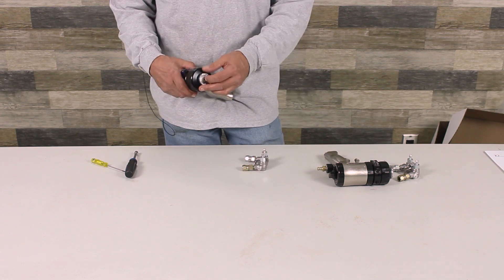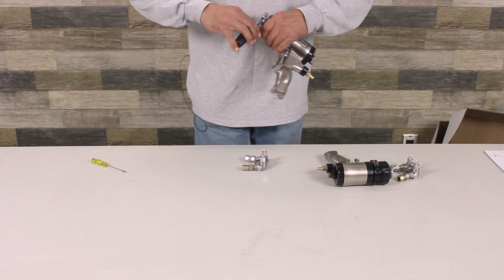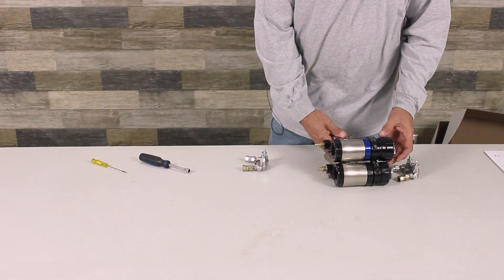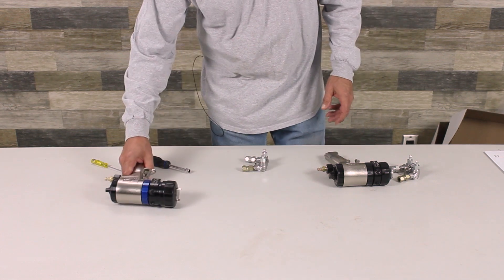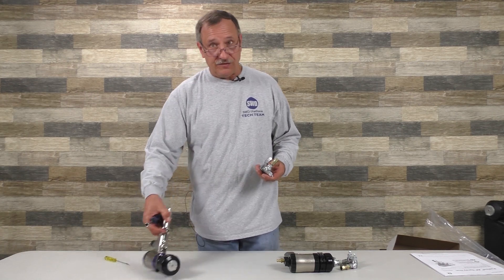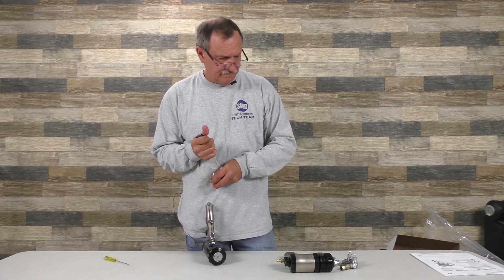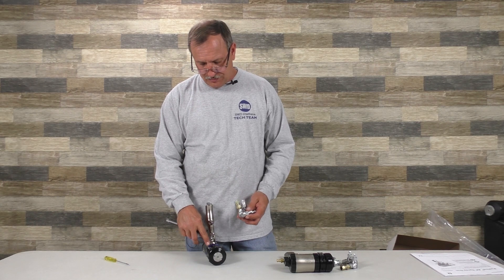Pressures are the same. This gun is about a quarter inch longer in the front because of the slide-on piece, and it is a little heavier — it pulls down on you. Keep these spare assemblies — if you already have it and you're not using it, keep it as a spare. Always make sure your valves are open prior to changing these out, because you don't want to have the valve all the way down and mushroom it. If you mushroom it, it's not going to seal against the O-rings.